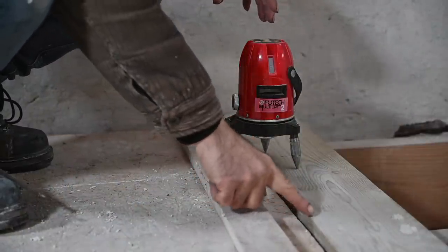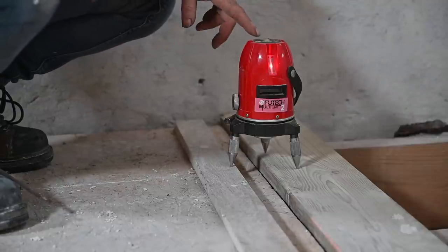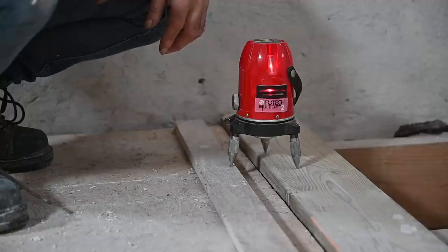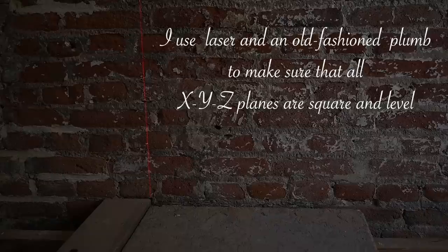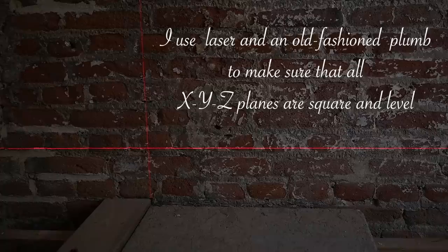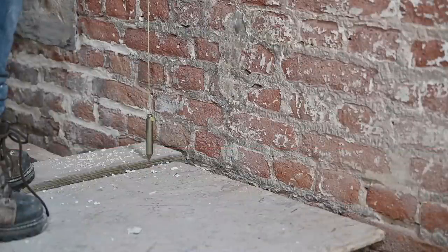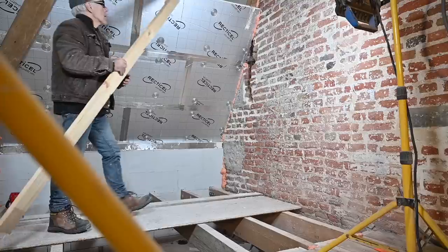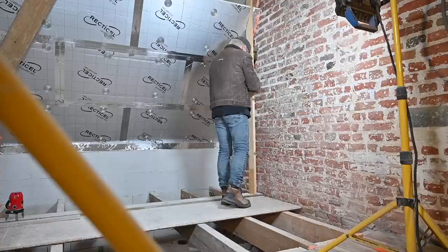I've placed the laser so the beam follows this beam here, then I'll check on the back wall where that ends up. I'll also turn on the horizontal laser to see how level everything is. With the vertical beam up, I can measure from the top of the OSB panel to the horizontal laser beam on both sides to ensure the back wall is absolutely vertical. I'm also using a plumb weight. I've cut the first stud to length and now I should be able to install it absolutely level.